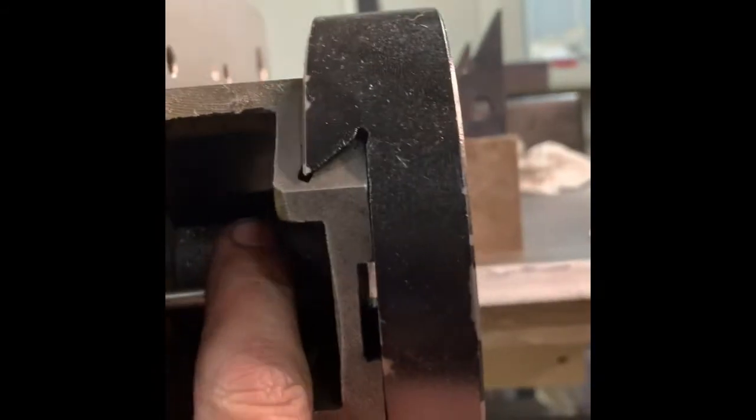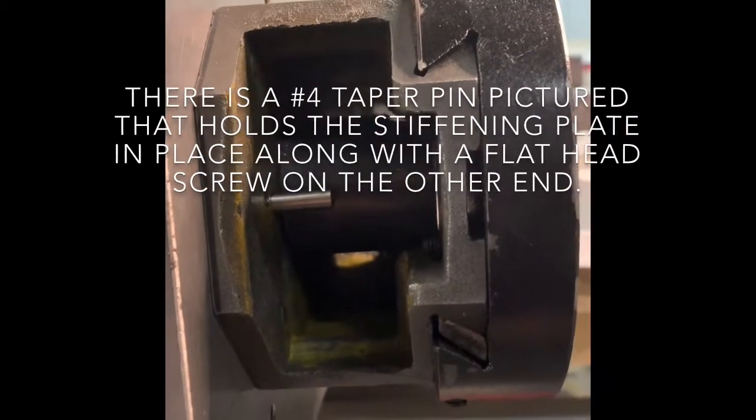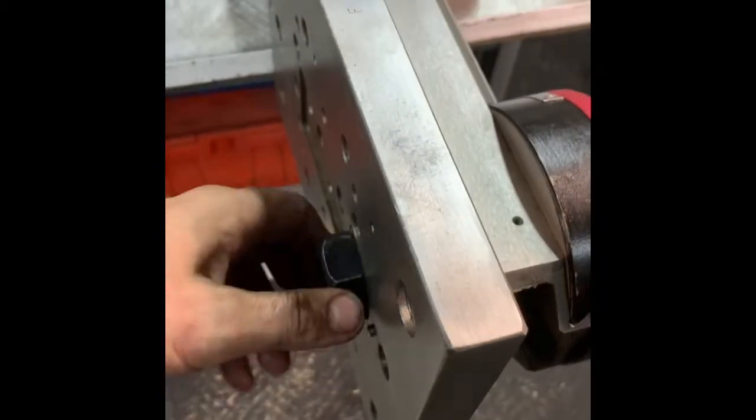There's no up-and-down movement of this disc on the column — they just did this to mount it. Inside there I put in a thick DOM tube so that when I tighten down on this bolt it won't crush and collapse the casting, because it's thin and cheap.